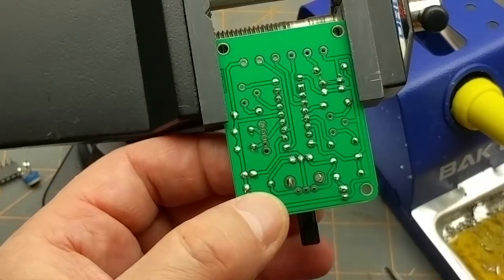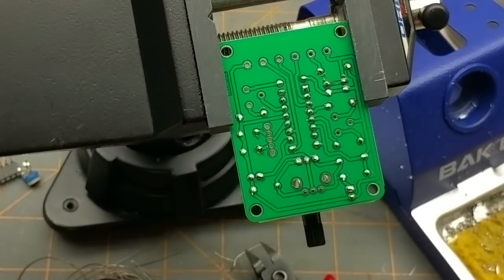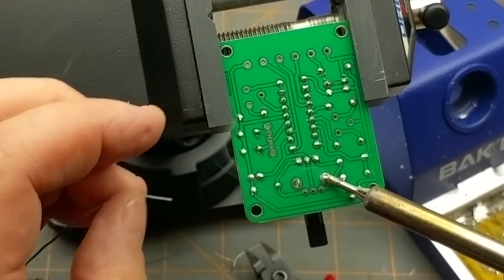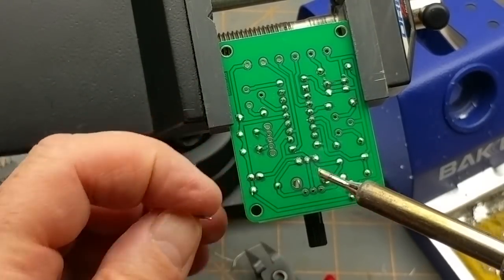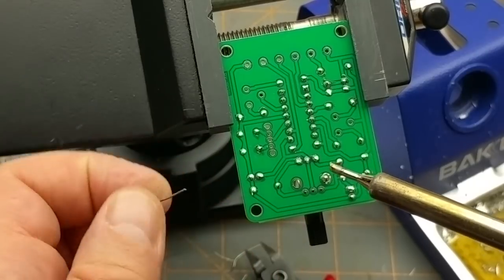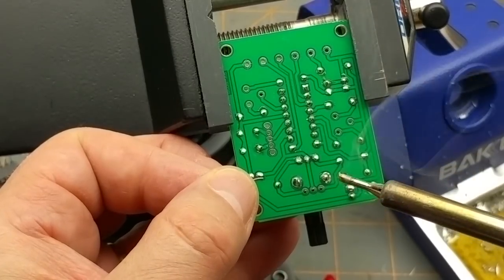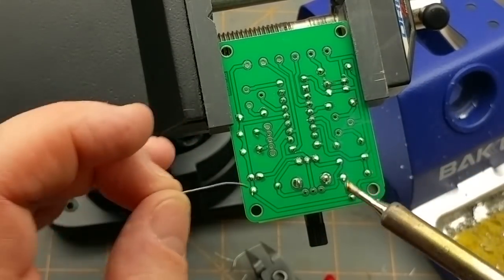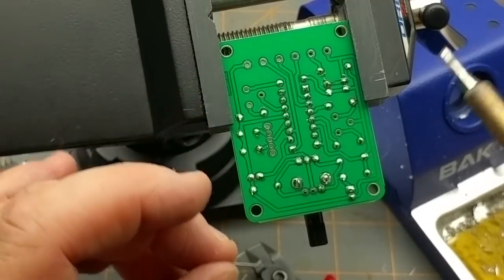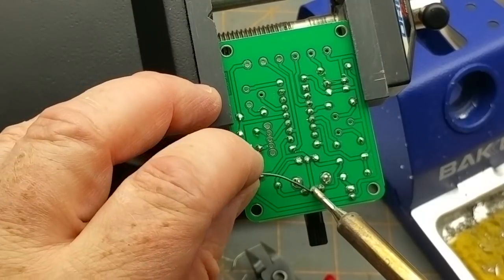And I think I'm going to just nudge those little mechanical grippers in. I'll solder them first. They're going to take a lot of heat. I'm just pushing on the back of it to reflow that so that it goes into place. Well, for those ones, they're not an electrical connection, they're just a mechanical connection. You don't have to fill the hole. And I decided not to. But they are making a mechanical connection now, so they're doing their job.